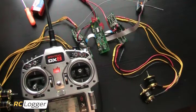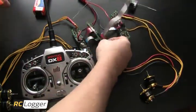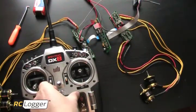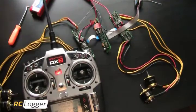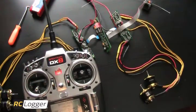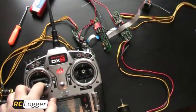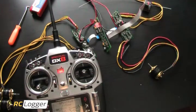This concludes the programming of your main control unit. The next thing we're going to do is unplug the main power supply and shut the transmitter off. We're going to turn DIP4 into the off position — now all DIPs are off. Turn the transmitter back on, then plug the power back in. You're going to get some beeps and some different lights. My receiver is bound, it has power to it, and the main control is ready. I'm going to start the motors by giving it left rudder — they're rolling. I had to shut that off because the motors were rolling across the table, but you're done — you've programmed all the channels and you're ready to fly your model.